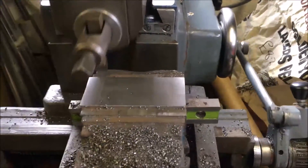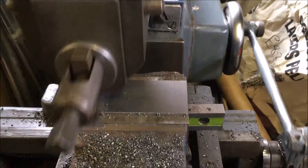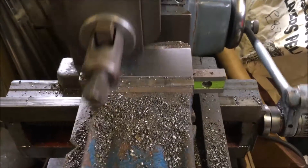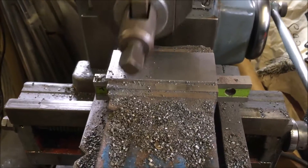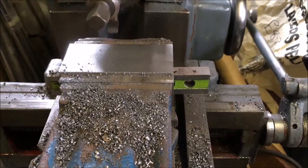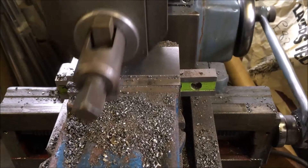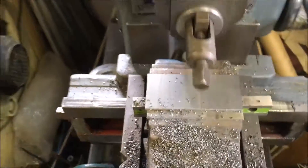This is a finishing tool, around about 3/8" wide, flat nose, radius corners. It's actually a brazed carbide — that's just because that's the nearest profile I've got. We're taking about a 5 thou depth of cut and a quarter of an inch, so 250 thou feed. Not looking too shabby — that's for the gray cast iron.